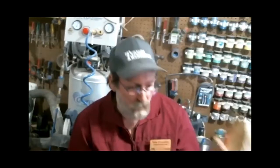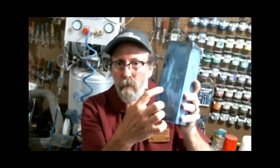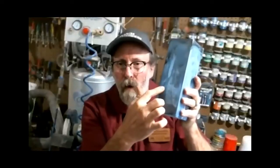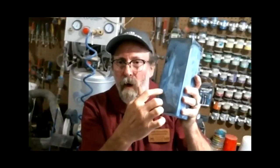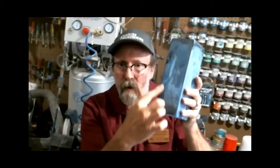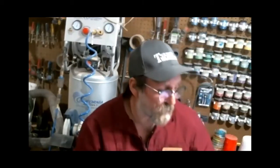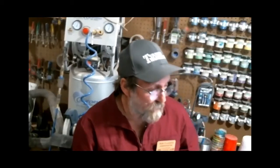If it was a colored blank, and it's blue, then I would use some blue mica with my CA. So what I would do is I put the mica in the hole, and then I drizzle either thin CA or I mix up some thick with some mica in it and just fill that hole with it. Spray it with activator, and then 5 minutes later, you're turning your piece. That's my way that I fill a lot of open voids. If the hole is bigger, then I would use like a 15-minute epoxy, or you have to do multiple coats of CA.